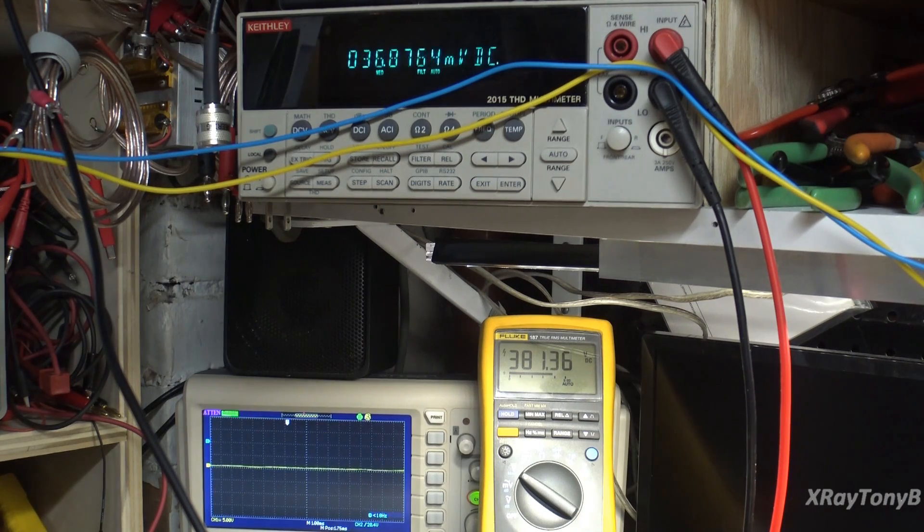Let's do the math: 25 watts. Remember when we were first talking about this, I estimated this amp — because of the reduced voltage — to be somewhere between 20 and 30 watts. We're right in there at 25 watts. Now why is it 25 watts? If you look at the design of the AA-864 Fender amplifier, which is what this thing is taken from — that's a 50 to 55-watt circuit. Why am I not getting that? Because we have 383 volts and the original Fender had 450 volts.